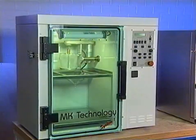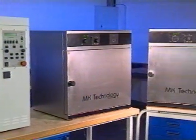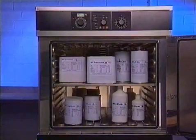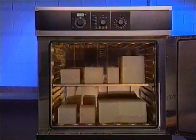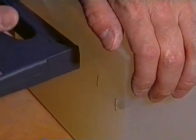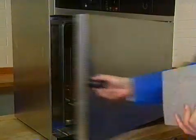To work professionally you will not only need the vacuum chamber itself, but also two ovens: one for tempering the resin at approximately 35 degrees Celsius, and the other for tempering the mold and the cast parts at 70 degrees Celsius. For the casting process the mold is closed either using tape or staples, which are particularly suitable for small molds. The mold is then preheated to 70 degrees Celsius in the oven.